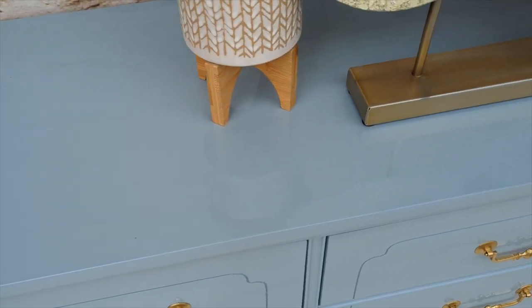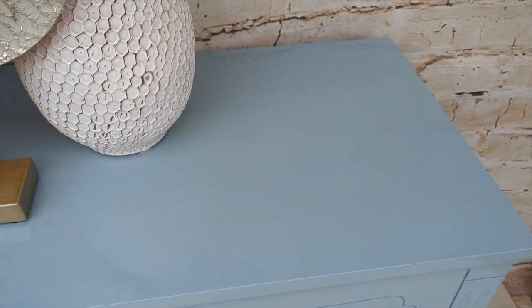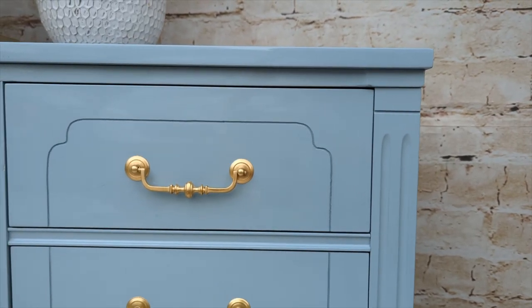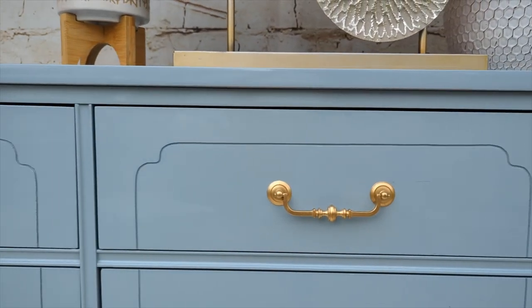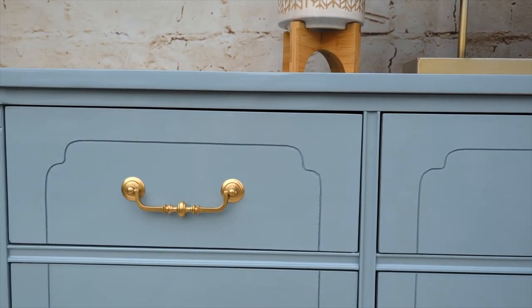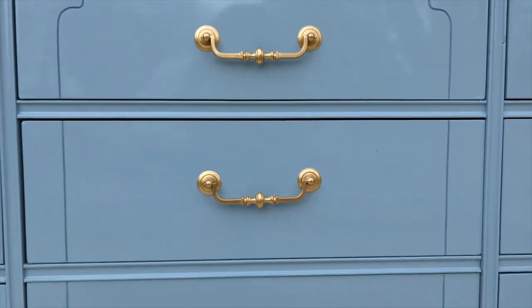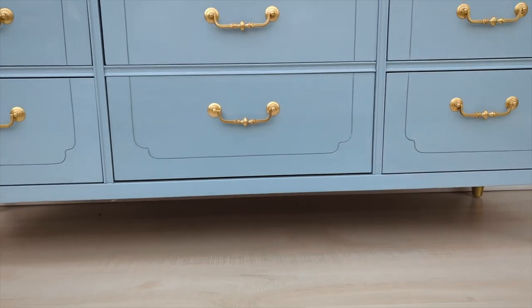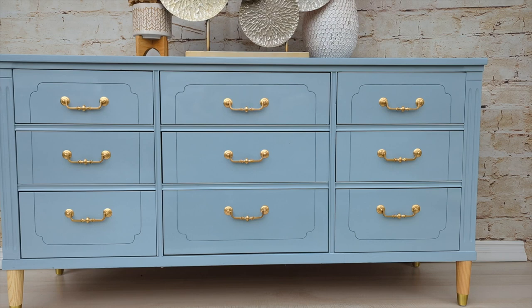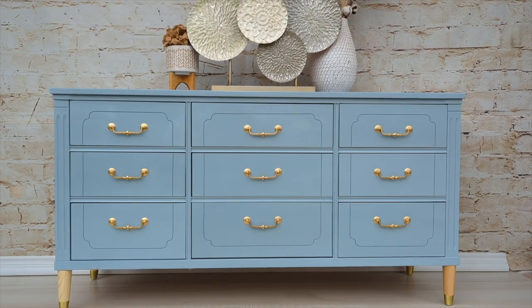I'm so proud of these pieces — this is my nicest high-gloss to date. I can't wait to try it again in different colors. It does take a long time; each layer has to dry for 24 hours and you can't rush this process. If you're working with other pieces in the garage, stop, wait till those are done, and then work on your high-gloss pieces and give them patience. Next week I'll show you how to stain and resurface old vintage furniture and how to work with wood stains when it's not actually wood. See you next time.